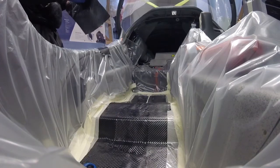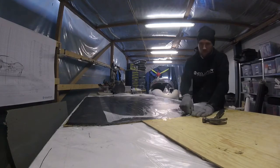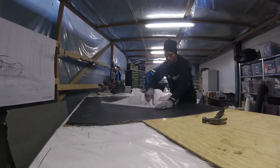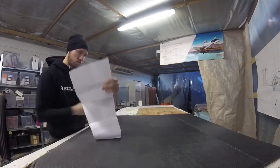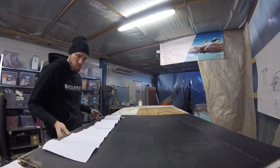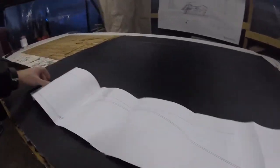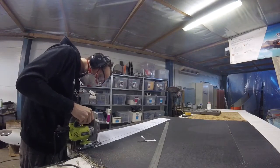By making a railing system we could quite easily create a flexible base that allows us to move the battery pack during testing and manipulate the CG. The boards we created were based on a plywood core, which is a really good way to make very rigid walls. I laminated a piece of plywood on both sides — it comes out quite heavy, but if you want something to hold a battery pack that weighs about 100 kilos and sustain a crash of about 9G's — that's roughly a ton of load — you need a rigid box, fixed to the belt fixtures in the passenger seat.